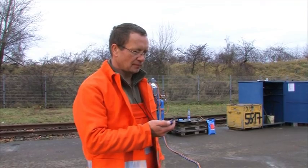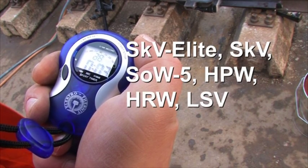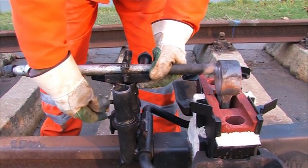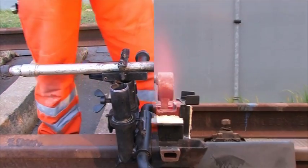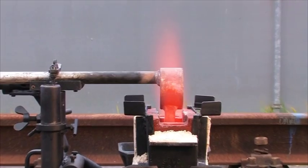Depending on the welding process, the finish of preheating is determined either by the passing of a time or by reaching a temperature of 900 to 1000 degrees. That is according to a yellow-red colour. It is to check visually. When preheating using compressed air and gasoline, then the setting of a stable blue preheating flame is very eminent.